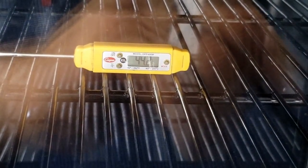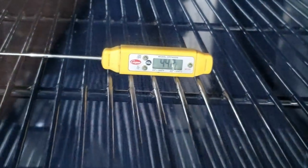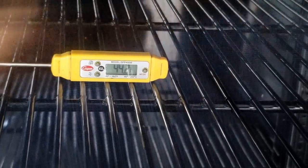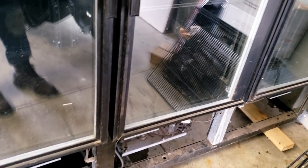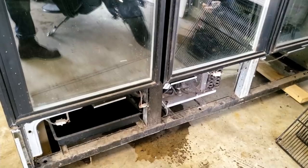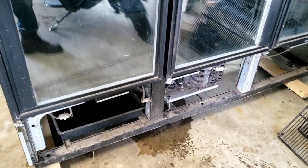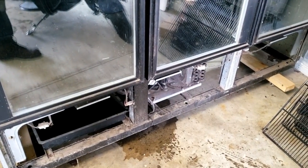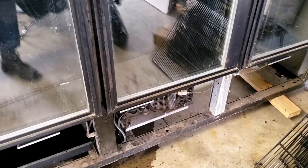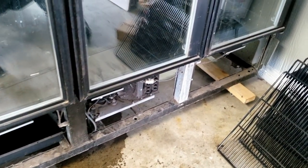It just shut off — awesome. We are at 40 to 44 degrees, and this is measuring coil temperature, not air temperature. I'm going to set the thermostat one notch colder — it's on number five right now which is the normal setting for True, so one more notch should keep them under 40 degrees. They're mainly keeping non-perishables and beverages in here. They are ordering new door seals so we'll get those on. We've been here a few hours getting everything up and going — that's why you want your coils clean and evaporators de-iced before a service call. Sometimes you just have to do what you have to do. If you enjoyed the video give it a thumbs up, subscribe, and check out our Facebook group at HVACR Survival — until next time!